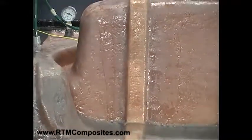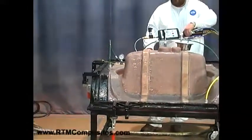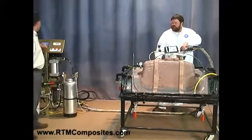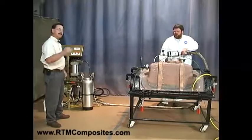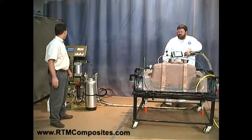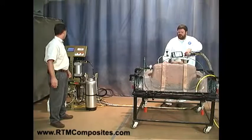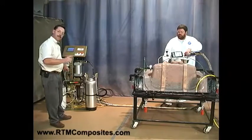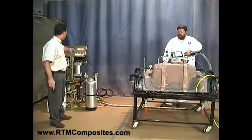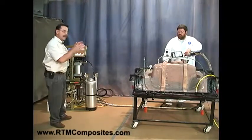We're flowing right now, and it just moved up to 1.5% all by itself because I've told it to go from 1.4 to 1.6%. We're flowing at 26 grams a second, which is the first step. Right now we're at 1.8 kilograms. At 2 kilograms, it's going to stop — here it is, 2 kilograms. It's going to reset its flow rate to 22 grams a second and then begin ramping up again. Here we've got a step flow rate to illustrate just how you do that.